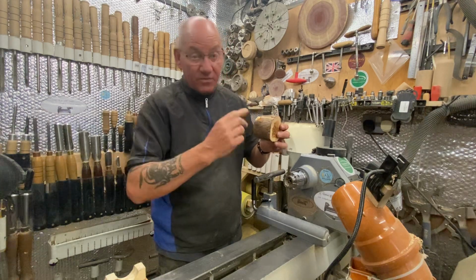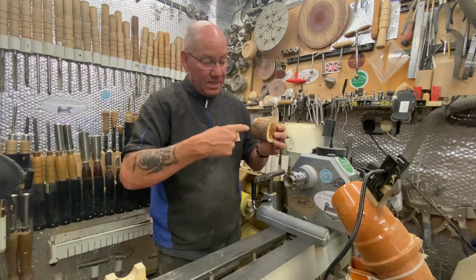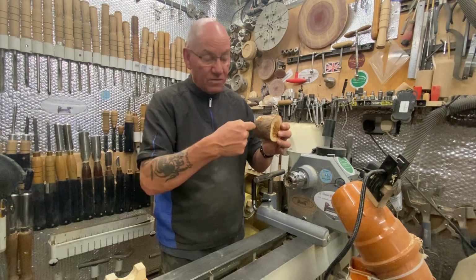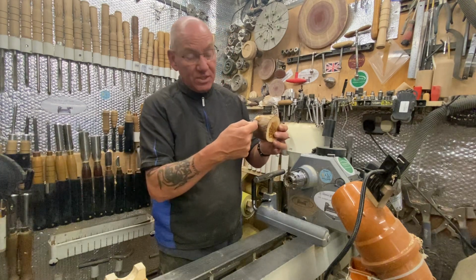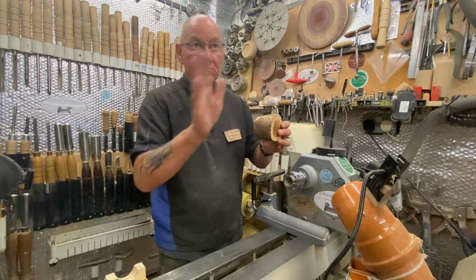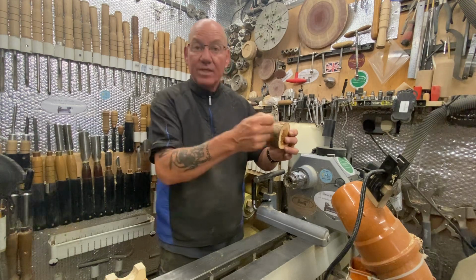Okay, face work, they call that, right? So you're going in that way, outside in, outside in. Always start from the outside, push cut, always finish in the middle. Every cut. And there's no reason why you ever have to go from the middle out.